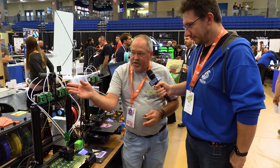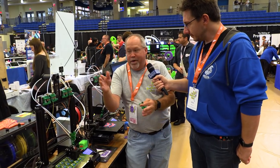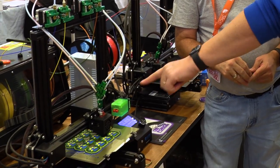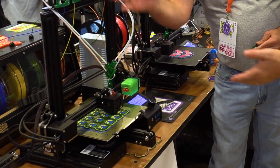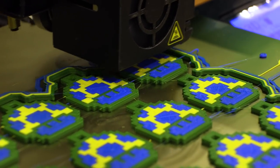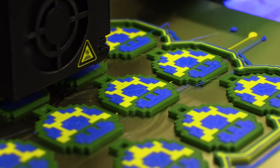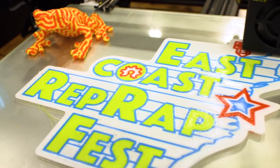The G-code says by hitting these mechanical switches, the printer's actually talking to as many steppers as you want. You can actually stack these things up. In this case there's only four, so there's two switches. If you wanted eight, you would have another switch down onto the Y-axis — the Y-axis would come and bump it, and that would change it from the front four motors to the back four motors. So the X-axis is hitting the buttons right now, but you can also have the Y-axis or Z-axis do that. We're using secondary functions of the primary motors when they're not normally doing their printing. You can even pair this up with direct drive or Bowden tube.